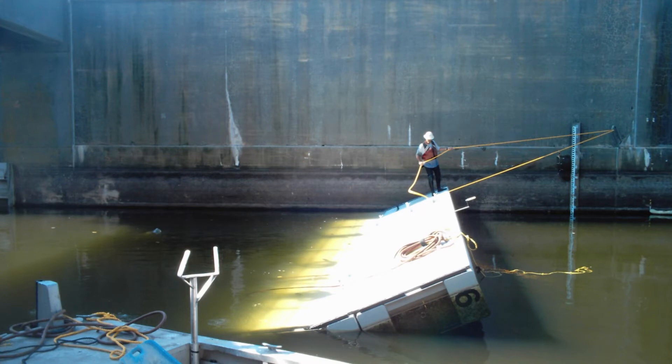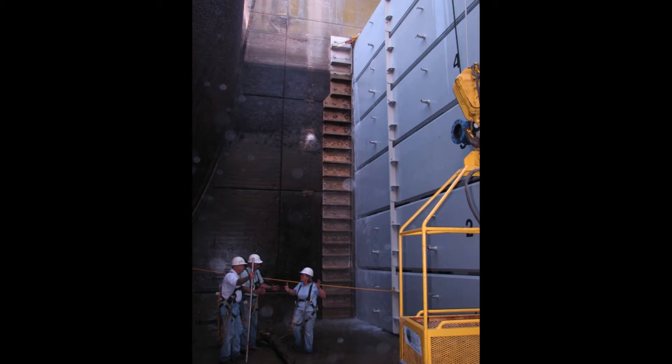Here is a bulkhead that is in the process of being descended as a fixed piece unit, so it is not hinged. You can see on the left side of the photo an abutment seat that this bulkhead is going to float up against. In this photo you can see the positioned bulkhead against the abutment seats, used in spillway bays where there is an abutment on one side and a pier nose on the other.